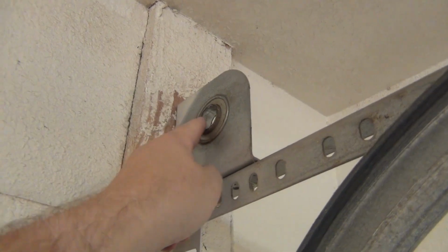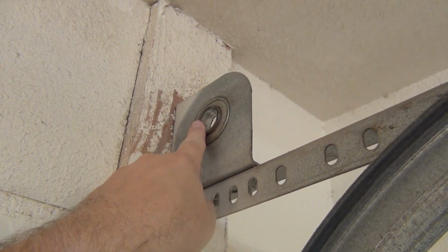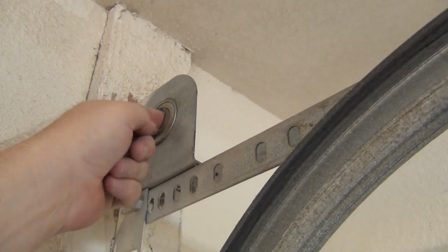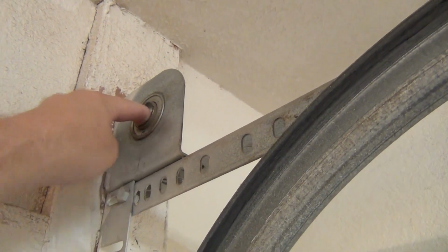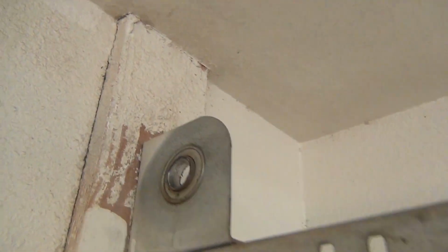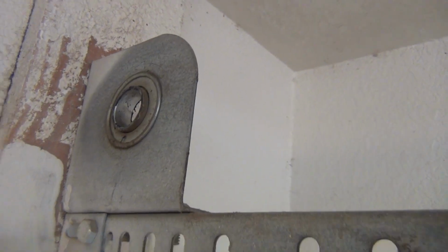Okay. I took off the pole. The pole goes through a bearing on either side. So for me, this isn't something you can do at home, but when I replace my spring, I make sure that this bearing bracket is good, so that I get my finger in there and I make sure that bearing isn't rattling or in any other way damaged. I check both sides because that is the bearing support for that shaft that the spring goes on.